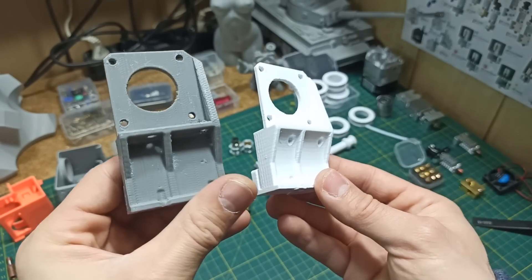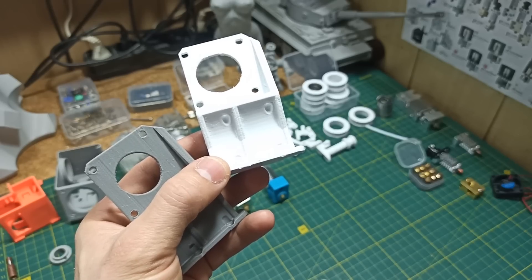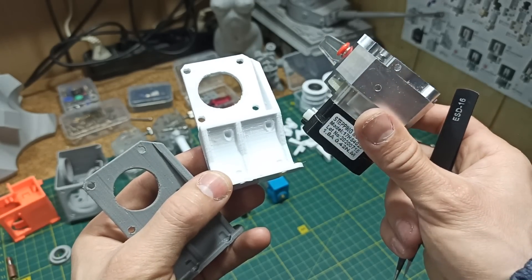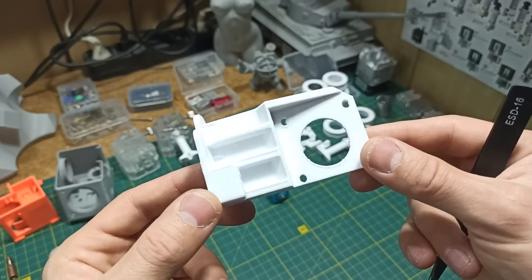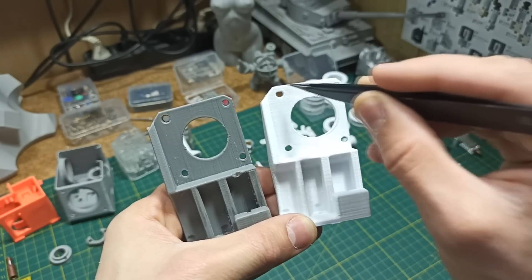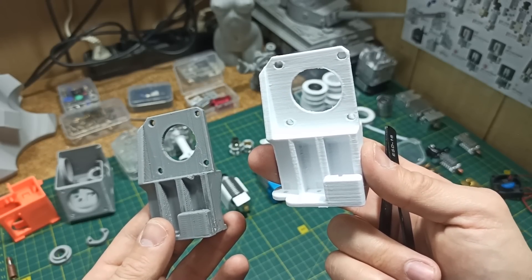The next improvement concerns the BMG holder. At the request of viewers, I added a small slope to this part — thanks to which the part can now be printed standing upright. By the way, this part was printed on the Ender 3 at 90 mm/s, acceleration 800, jerk 10, with a BMG Wind extruder. If you have a direct drive, I recommend buying one — it handles all plastics without exception like a Kalashnikov. Nozzle used was 0.4, layer height 0.3 mm. Also in this model the central hole has been enlarged and made more oval, and the mounting holes have been widened so the motor can be shifted slightly left or right. In any case, I recommend reprinting this model — it will make further assembly easier.